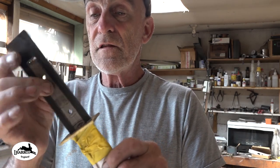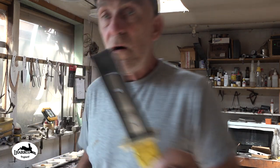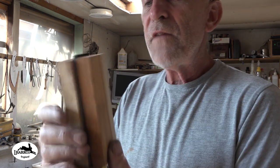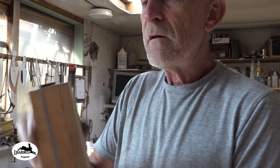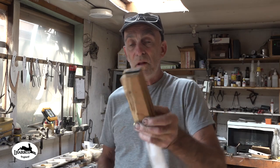I did a quick grind, paid no special attention to the finish, did an etch, and I like the pattern — it looks really nice. What I'm going to do is handle it: the handle is basically just a piece of G10, same thickness as the tang which is four millimetres. I'm going to put a piece of English yew on each side of this G10 like so, and that handle will be pretty noticeable — I'll be able to see it easily.